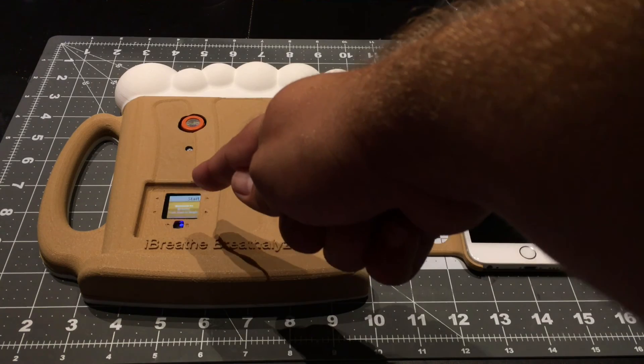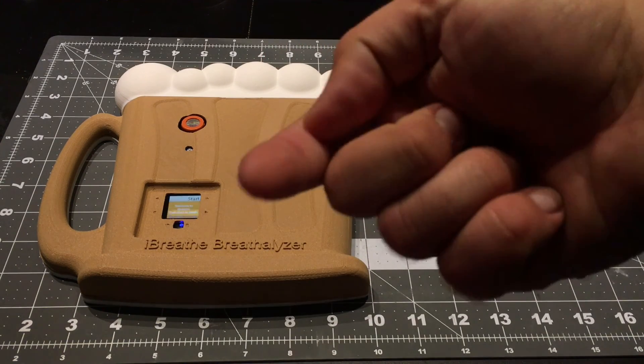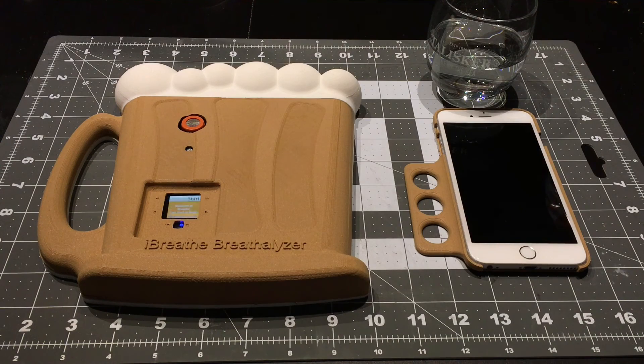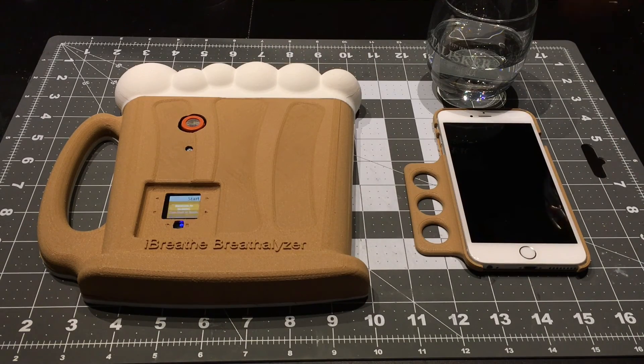You can see flickering here — I cannot see flickering on the device itself. It's all to do with refresh rates; this display is refreshing faster than the camera, and you're getting aliasing and all that horrible stuff. Just ignore that. It's not flickering in real life. It's an OLED using slow serial to load itself.